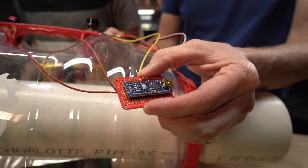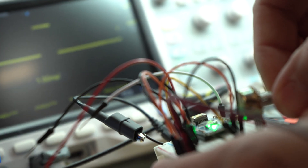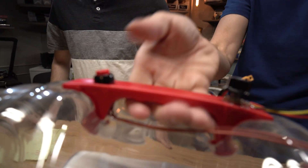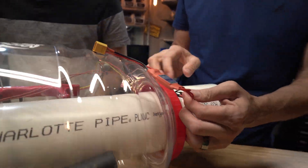The battery goes to the electronic speed controller. The ESC does two things: it powers the motor and it powers the other electronics, in this case an Arduino. We needed some way to control the ESC — it needs a signal to tell it how fast to go. You can't just put a dial into an ESC directly; you have to drive it. So we used the Arduino as a motor controller that sends the signal to the ESC, and we used an analog potentiometer to adjust the speed. Christian helped us write code to do a ramp-up, so when you push the button it doesn't kick the motor on at full speed — it ramps up slowly to max speed, which is easier on the system.